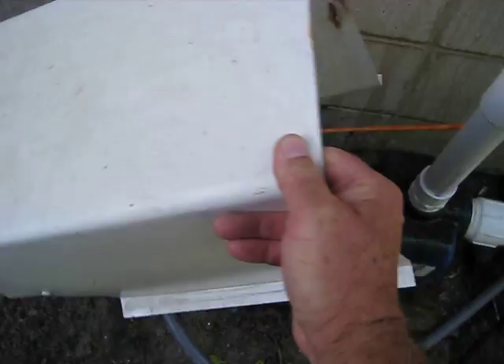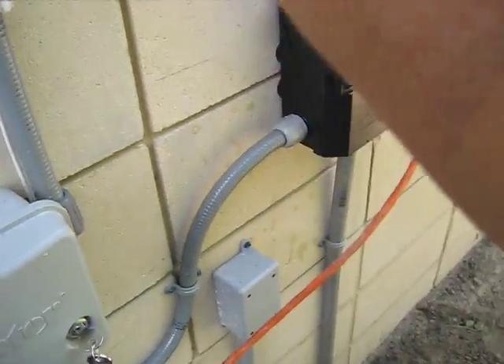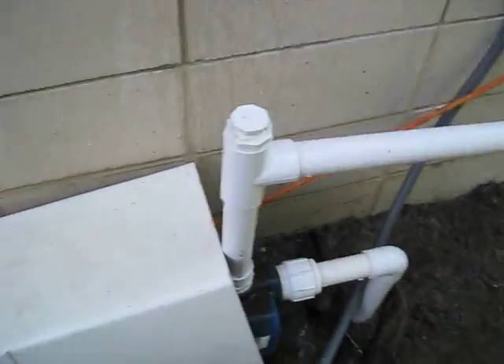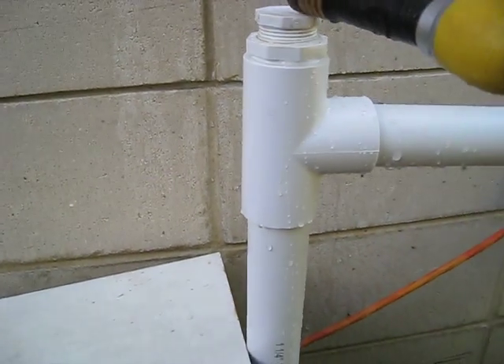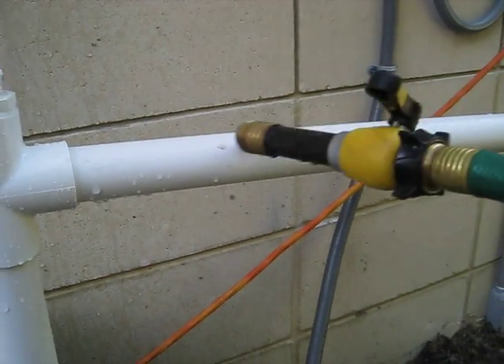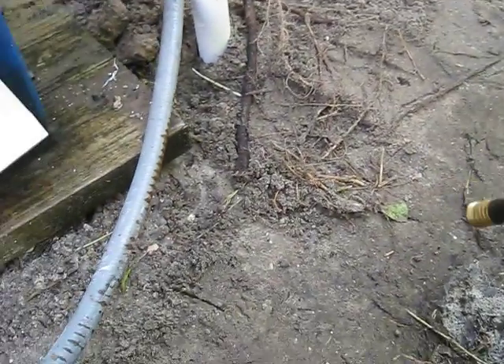An old Arrow motor, still going strong. We're going to put this cover on it to keep the rain off. So now we're ready to install the irrigation system. How we got to this point: when you plumb these pumps up, what you're supposed to do is put a T at the very top right here, and then a plug up on top that can be unscrewed. This is your output line right here — this is going to go to your sprinkler system.